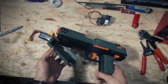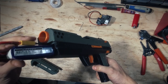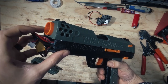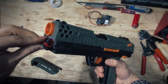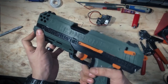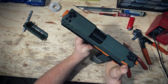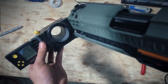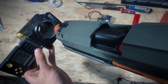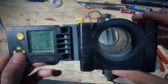Now we've got it together. We'll put the battery in quickly — take off the tack box by taking out the pin, plug in the battery, and it's easiest to put the battery in first. Once the battery gets past the lip on the slide it'll be able to slide back and forth freely. Tuck the wires in on top and to the side, then test to make sure it will slide when the trigger is pulled. Slide the mag in, blowback is engaged, and we've got a full magazine. We're going to see how it performs with the chronograph. We had an average of 115 fps with a high of 137.